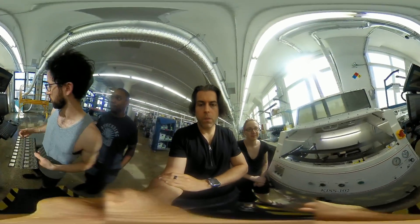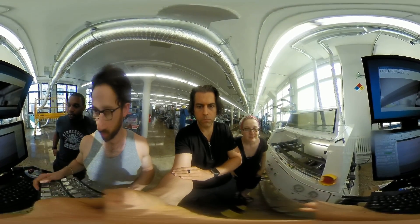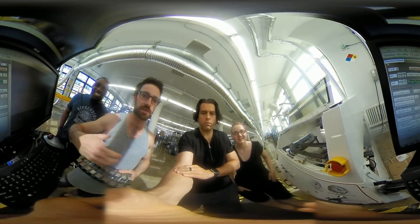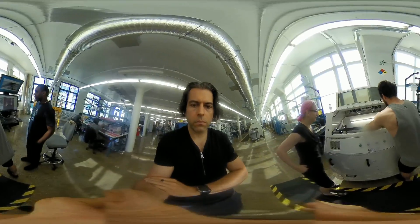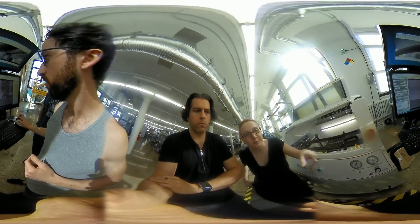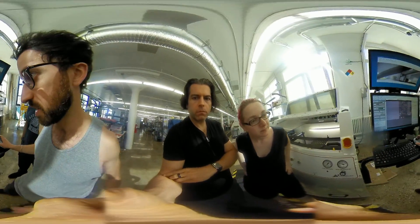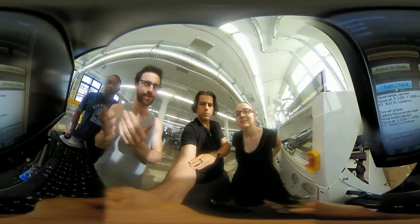And this is the screen over here — the process screen. Right now I'm in the process control tab and I'm ready to put another board in. I have my pump on right now. I like to keep it hot so that the nozzle doesn't cool off, and I can just move on to subsequent boards. So I'll put this board in. You have to bank it against this stop right here. Now you can see the board. This is my registration — I set the board's fiducial mark for this process, and it gives me a confidence reading down here telling me how well I think I can do this.